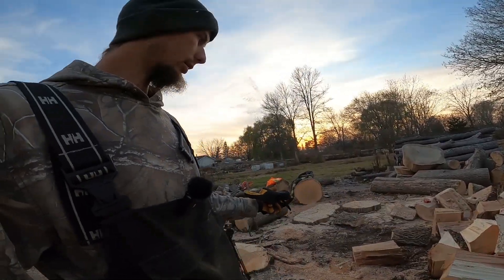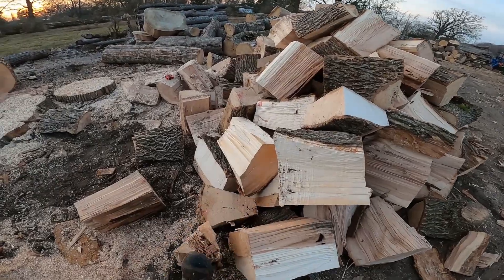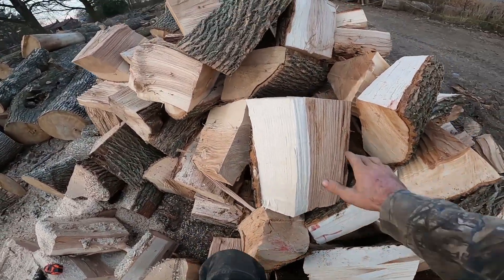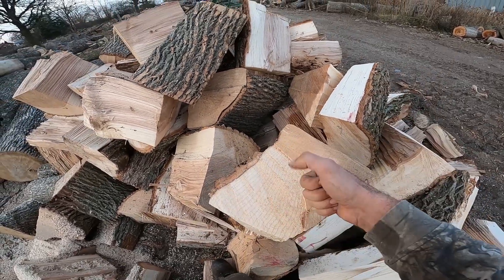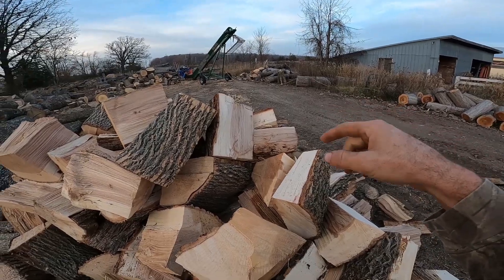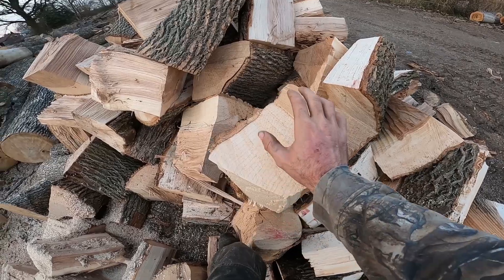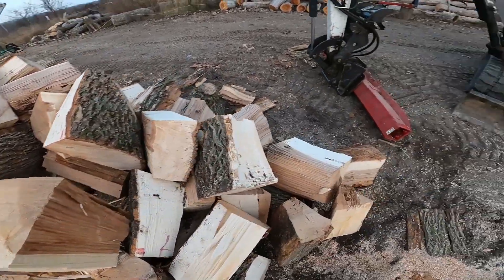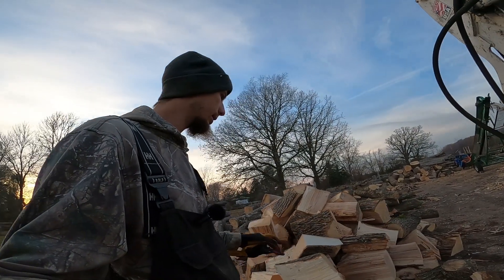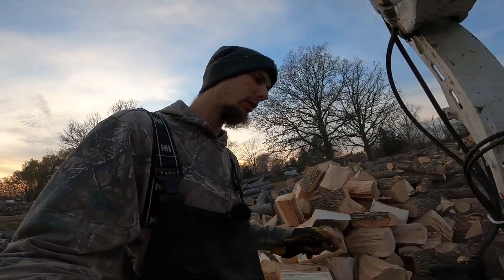It took all of three minutes to slice that whole big one up into chunks like this. So I would call these boiler chunks, but now it's super easy. I can grab all these with my log tongs and park the Easton Maid beside the pile, and this will be chewed up real quick through the four-way. Each piece is about four-way-able, and then there's no really re-splitting, rolling big pieces back, or having the chance of a big piece rolling on you.